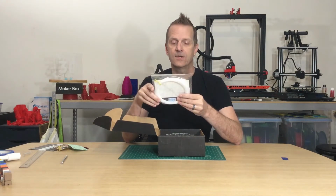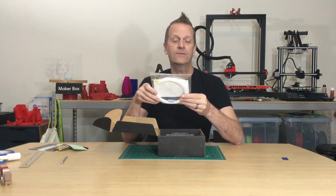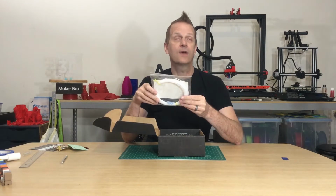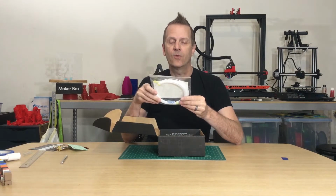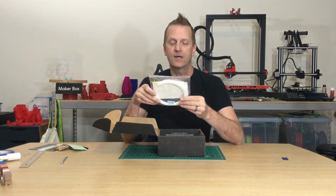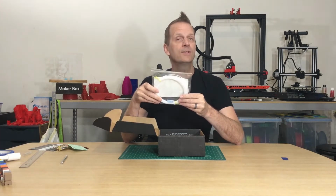And it's Hips material, so it's actually a dissolvable thermoplastic, which is ideal for printing supports with ABS parts. Hips is easily dissolved in limonene and prints at similar settings to ABS. It is less prone to warping than ABS, making it perfect for brims and rafts on small and large parts alike. Also good for general printing. Selected for this month based on customer request at Earth. Awesome.